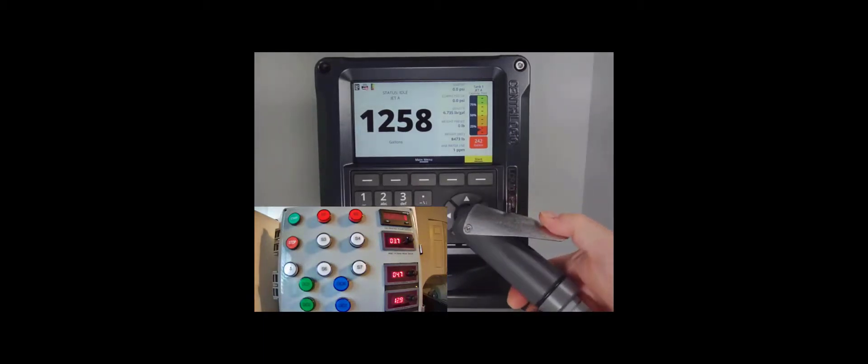Now to demonstrate this feature, I'm going to add a second camera showing my simulated control panel. Up here is S1 — that's your primary flow control for the system. Down here is my Digital Output 1, which is my indicator lamp for my Deadman control. Lastly is my Digital Output 2 — that lamp won't illuminate, but that's my buzzer for my warning timer. I've also connected a Deadman handle to one of my digital inputs. I'll press the start button on the register, which will cause the counter to reset and then be ready for an active delivery. The status is active and the screen is yellow showing we're in an active delivery. You'll notice on the control panel, my S1 for my primary control valve and my indicator for my Deadman are both not illuminated, because I have not triggered the Deadman handle yet.